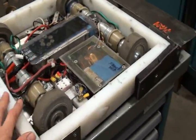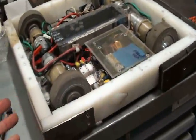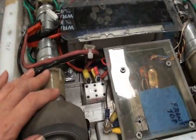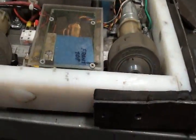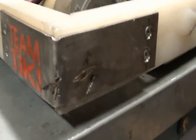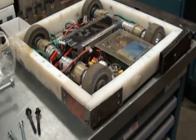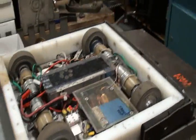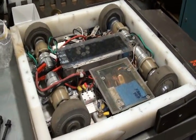Its 30-pound counterpart CR-30W was running basically the same setup — same battery, same speed controllers, same motors, same wheel size, different frame. All in all, these motors did not seem to be up to the task. The bushings were a bad material choice. The white plastic was pretty good, and the stainless bumper guard took some nice hits but never came off — that's a pretty good choice. But all in all, not a very successful combat robot, though I learned some stuff.